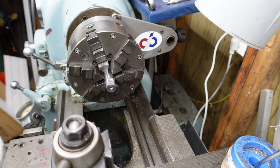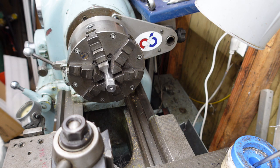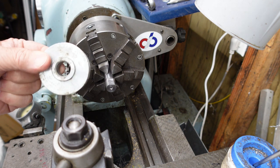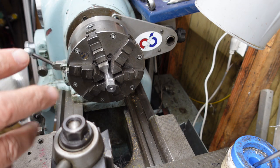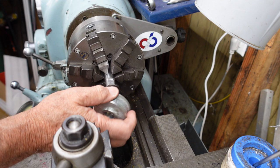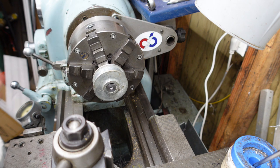You can see in the lathe I've got a round stock stub mandrel. It's got a flat cut on it and a center drill in it. I've already mounted it once but haven't done any turning on it yet. Here's a pulley off a vehicle for a serpentine belt — it's an odd diameter, I think it's 668 thousandths. To create a stub mandrel you need to turn it to that diameter so the part will fit on there.